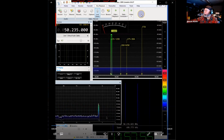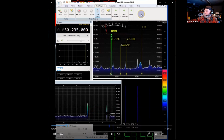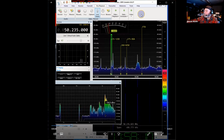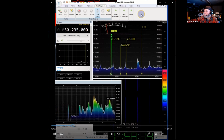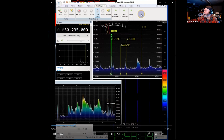That's me transmitting, so it mutes the signal. It just turned back on. There's minus 122, which is my noise floor. There's a burst of minus 106. That is a classic meteor ping. Immediate sharp rise, decay over time, and what KB7IJ calls an aftershock.